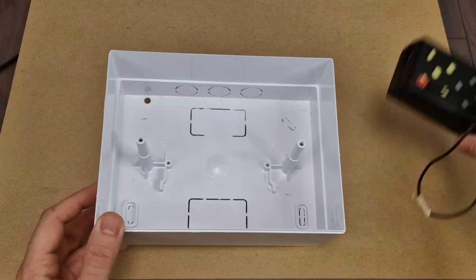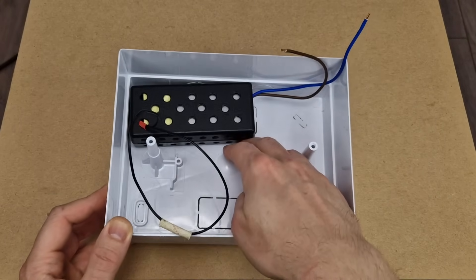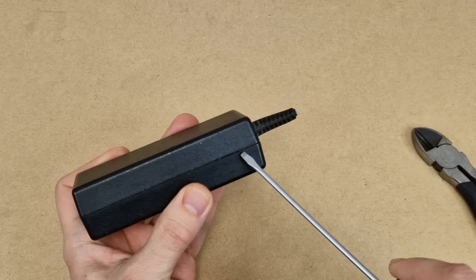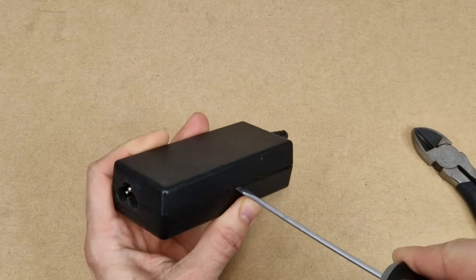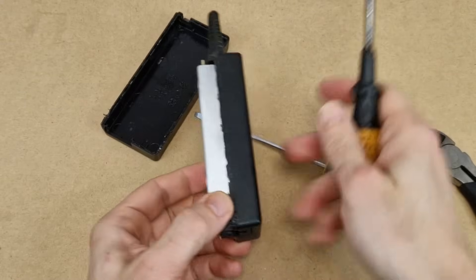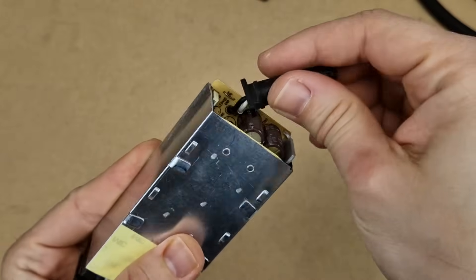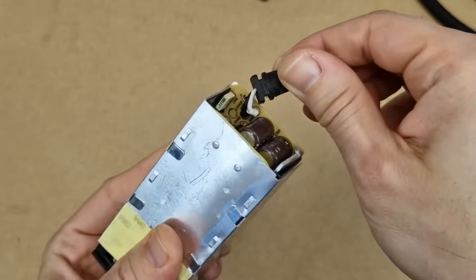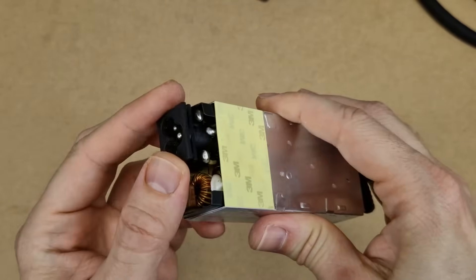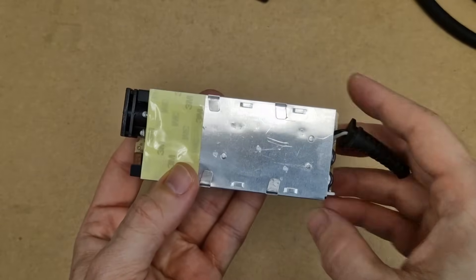The charger or power supply will sit inside around here. I made some modifications to the laptop charger — I cut the cable, because the charger will be mounted inside the UPS so the cable is not needed. I will pry open the charger case using a screwdriver. These are the wires that normally go to the laptop; I will replace them. On the AC input plug I will desolder one of the mains wires and add an on-off switch in series to turn off the entire UPS.